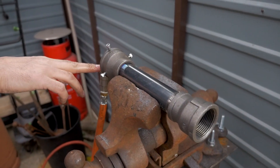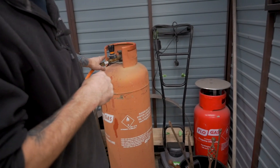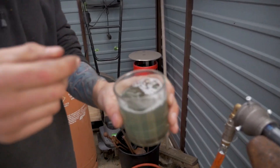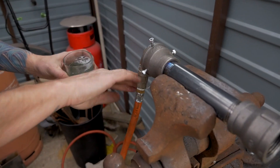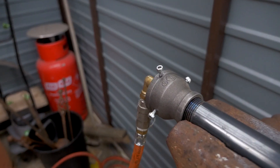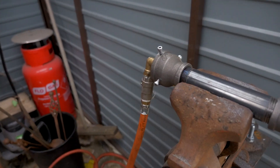Okay guys, a disclaimer before we go any further — if you make your own burners, you do so at your own risk. I take zero responsibility for anything that happens. That being said, we have our burner rigged up onto the gas. We have connected it in with the arrestor to protect it. We turn the gas on, and we have some soapy water here which we put on all of the connections to make sure none of them are bubbling. If they're bubbling, you don't have a seal. This is really important — this is part of being as safe as you can, considering what we're building.